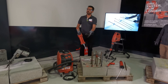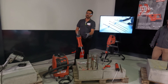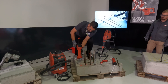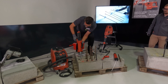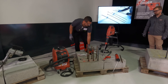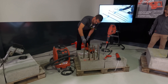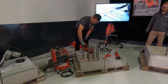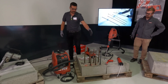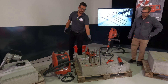Now we are ready to bring the mortar resin into the borehole. But typically a tradesperson has the challenge of deciding how much mortar is required. To be on the safe side, they add some extra. So, cleaning the hole with the threading and pumping it in, then setting the elements. This is for sure a safe installation — the borehole is properly filled. But as you can see, you never get a consistent installation quality, and the mortar overflow you can see here is waste.